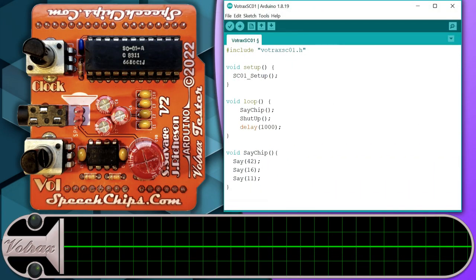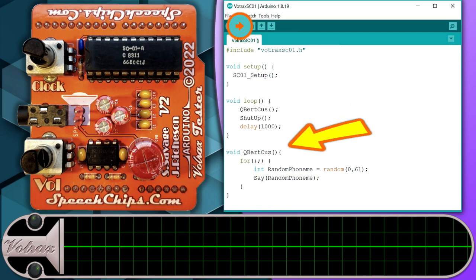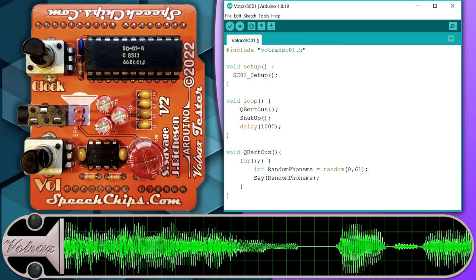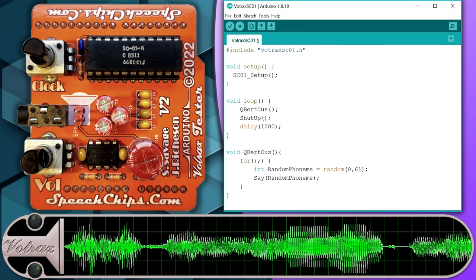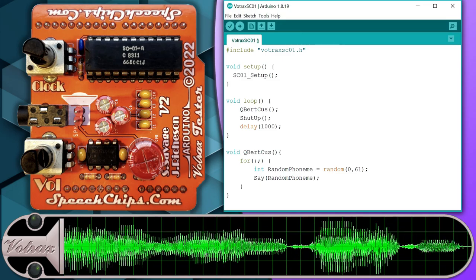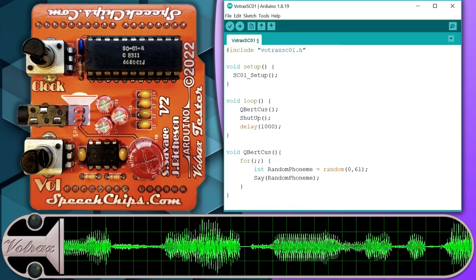What this tells us is that Dave didn't research and program a list of dirty words. Instead, he just created a procedure with a single loop, generating a random number inside that loop and sending it to the Votrax. But when we download this to the tester, it's clear that Warren was holding out on us — there is more to this recipe than just random phonemes, because the obscenities never end and the pitch is too low. We need to fix the continuous stream by chopping it up into individual bad words of random length.